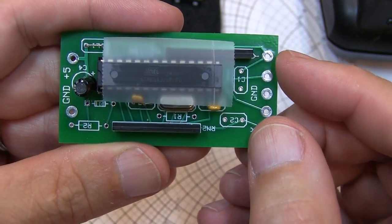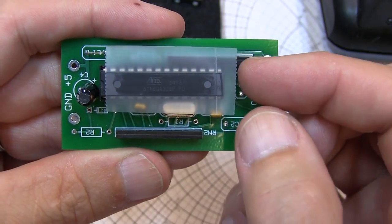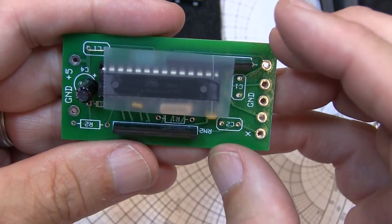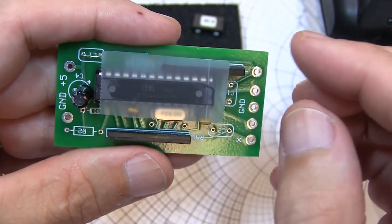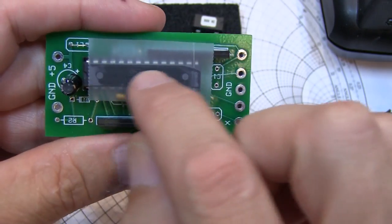You also want to take a little care sometimes when you're doing this — cellophane tape can be a source of ESD. So you want the part generally to be mounted in a circuit board; it's usually okay. Maybe stick them on a piece of dissipative foam or something like that if you're concerned about it. But just take general good ESD precautions, especially when removing the tape.